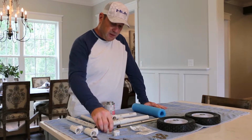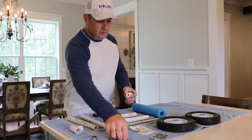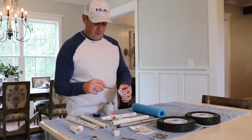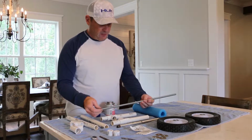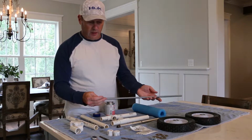2 of the plugs which fit into the T. And what I did is I used a small bit to drill a pilot hole, and I used a 1/2 inch wood bit to drill it out big enough for what I'm going to use for my axle, which is, and you can buy this straight off the shelf at Lowe's, 7/16 by 14 threaded rod.